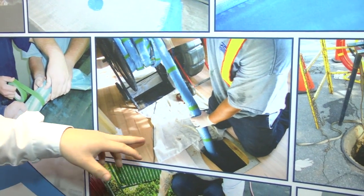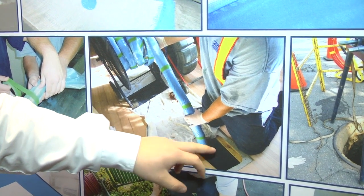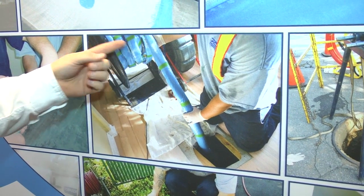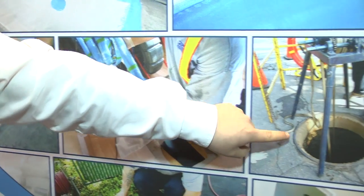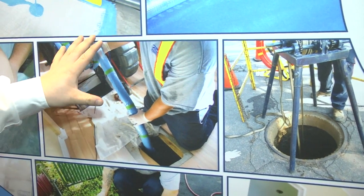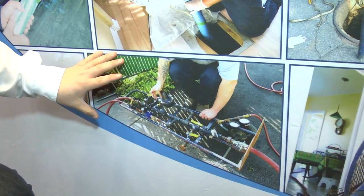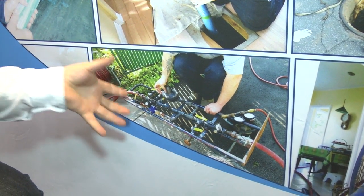That's the installation of a lateral — it's inside a house. You can't see it, but you've got the main clean out under that trap, and the big reel — you can see the repair reel over it. It goes in and it's pulled from the manhole with the nylon sling. So you've got one operator that pulls it and one that pushes it in. Once it's in place, you steam it all — you put the steam in at the right pressure. You've got all the gauges, all the controls, everything you need.